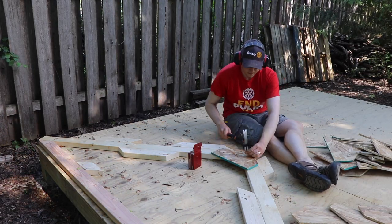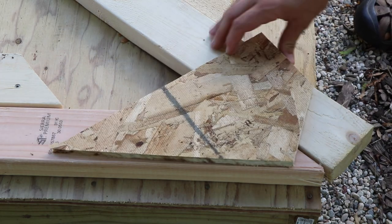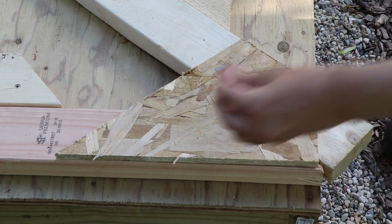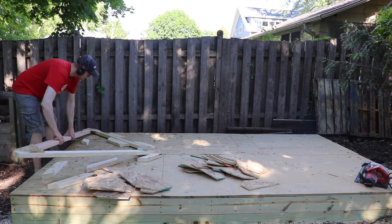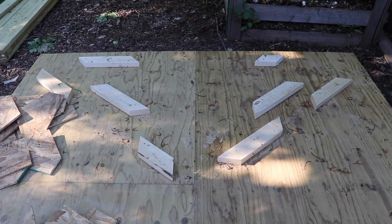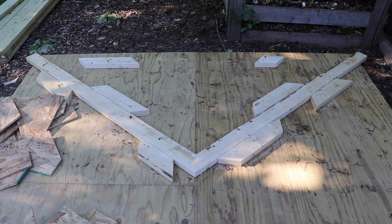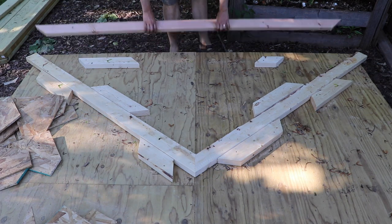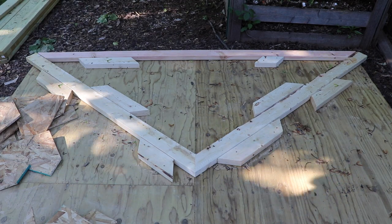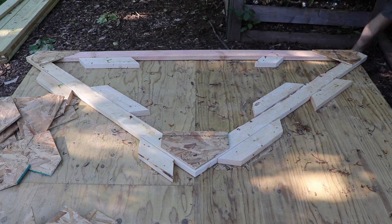If I were to do it again, these are some things that I might do differently. It would have been nice if I would have set up a stop block at the end of my chop saw so that every single cut would have been exactly the same. I have a little bit of a tough time doing angled cuts, so I'm off an eighth of an inch here and there, and not always in the same spot. So these crossbars don't go exactly in the same spot as the diagonal bars, which means some of them are slightly higher and slightly smaller than the rest, which has ultimately resulted in the roof kind of being wavy — but it's only an eighth of an inch or so every 20 to 24 inches. Not a huge thing in the grand scheme, but that's what I would do if you're a stickler for accuracy.